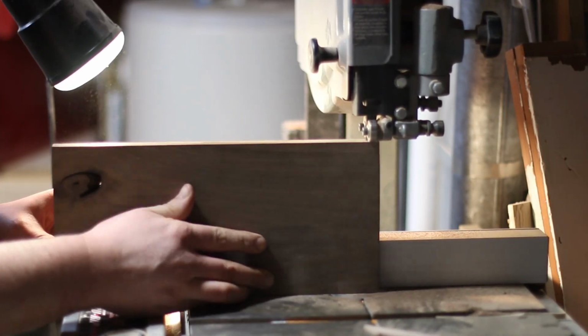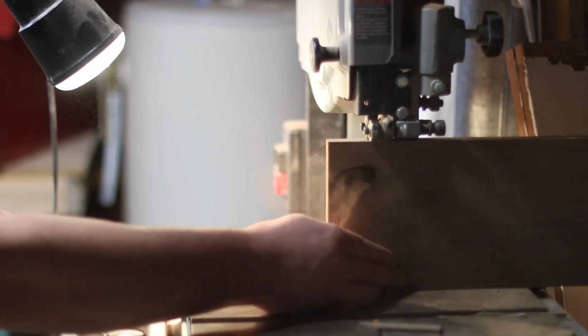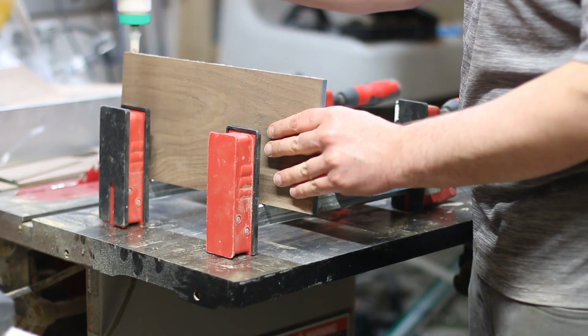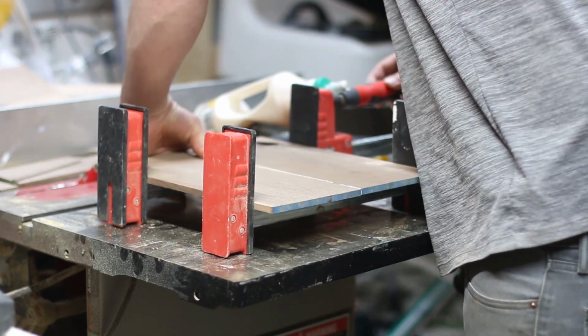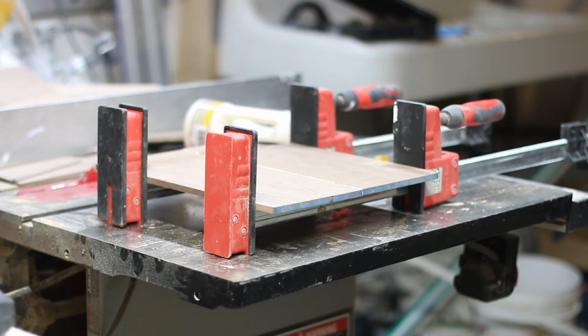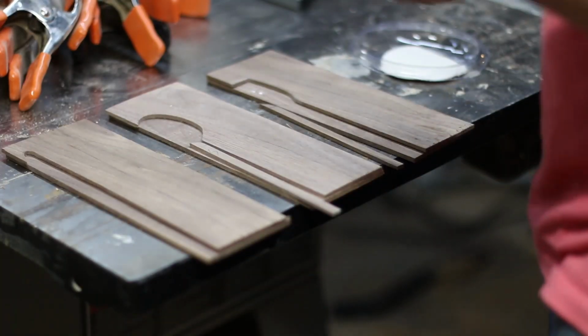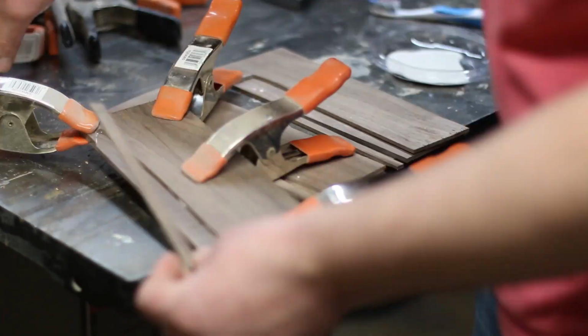After the top part of each utensil was cut out and fine-tuned, I went ahead and made the overall bottom portion. The bottom of the panel is made up of a solid portion that is 1/8 of an inch thick, making the total thickness of each bottom panel 1/4 inch. Once I had the thickness of the bottom piece dialed in, I glued the pieces together before starting on the epoxy.